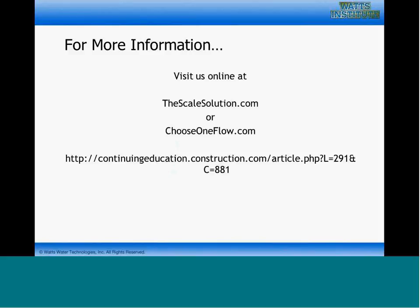We say in the instruction manuals, the straight answer, of course, is 3 years. There are some applications where it may have to be a little bit more than that, and some applications where you encounter really ornery water, or perhaps sediment reduction was not employed when it should have been. You could experience a little bit of early life on the media, but by and large, we recommend 3 years replacement. That is what's recommended based on a lot of the historical data that we have. You should feel very safe recommending that and doing so proactively.